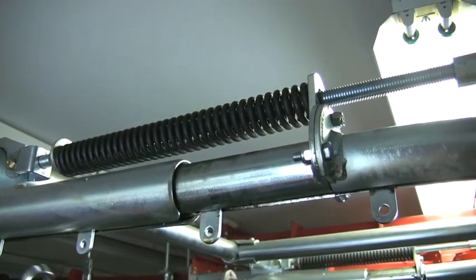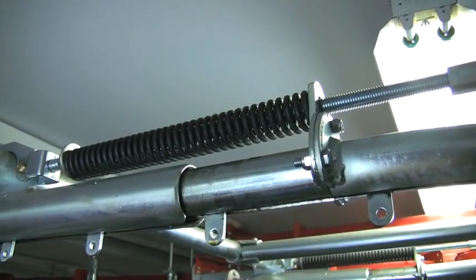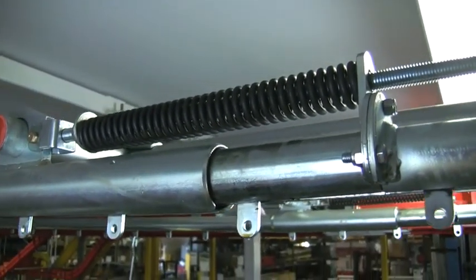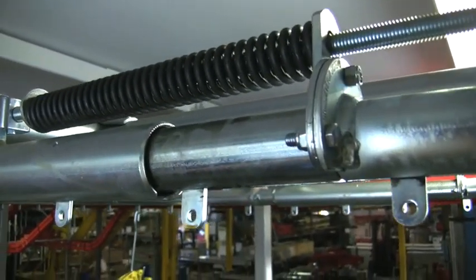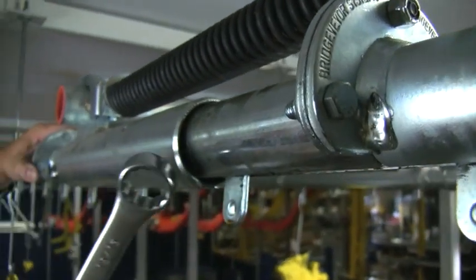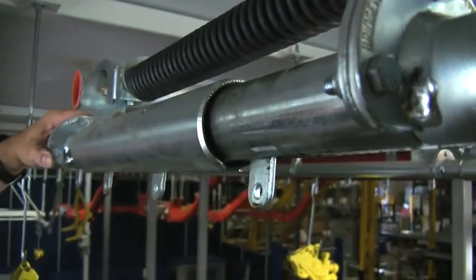Why at the lowest point? Because the chain, with the loads hanging off it, has some weight to it and it'll try to run away downhill. So it's actually going to naturally suck the chain out of the slack side of the drive unit, and then the take-up will be sitting there waiting to take it out.